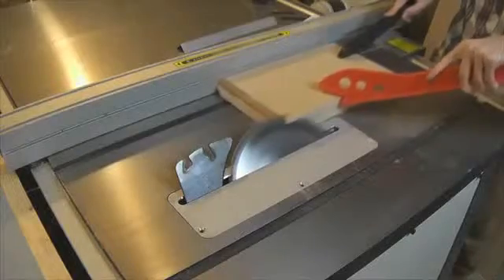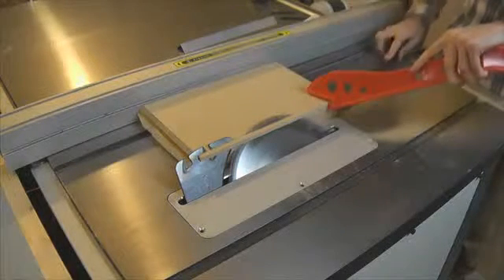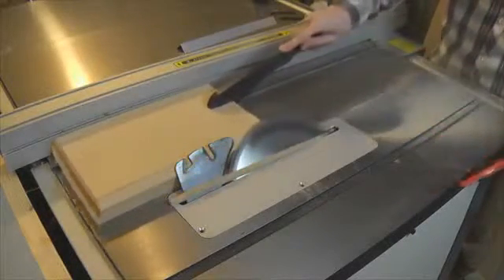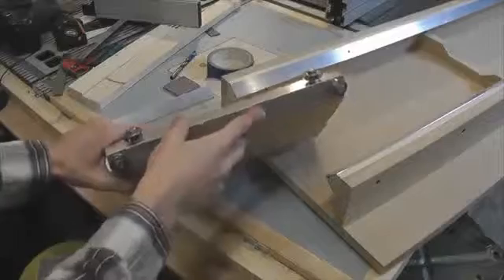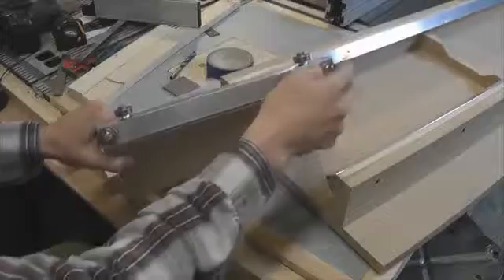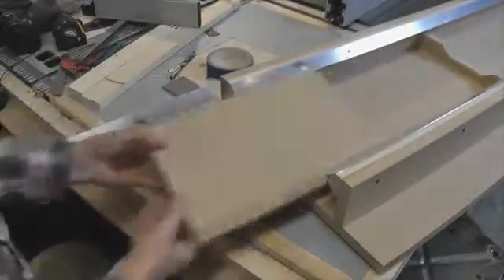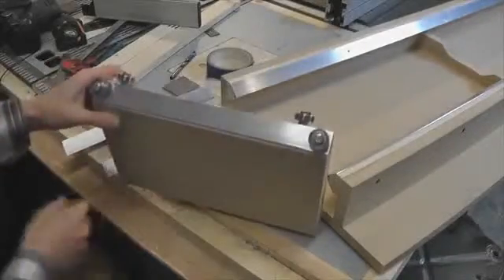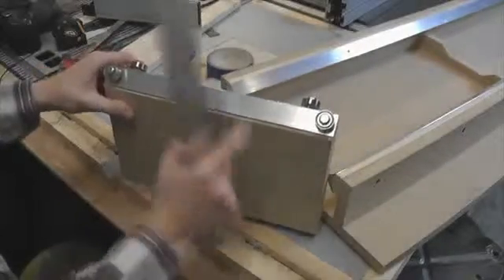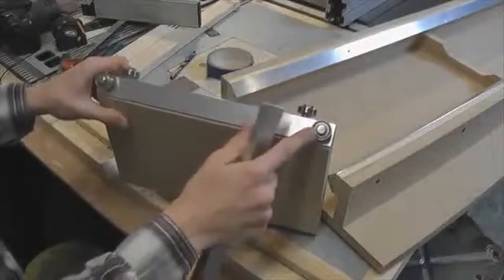Next up I have to make the carriage, and this time instead of using a chamfer bit at the router table I'm using the table saw. To allow the carriage to run along the rails I'm using bearings which ride along like that. I've still got to do the other side, which means tapping into another piece of aluminum angle, so I'm heading over to the drill press to drill out the holes to attach the bearings.